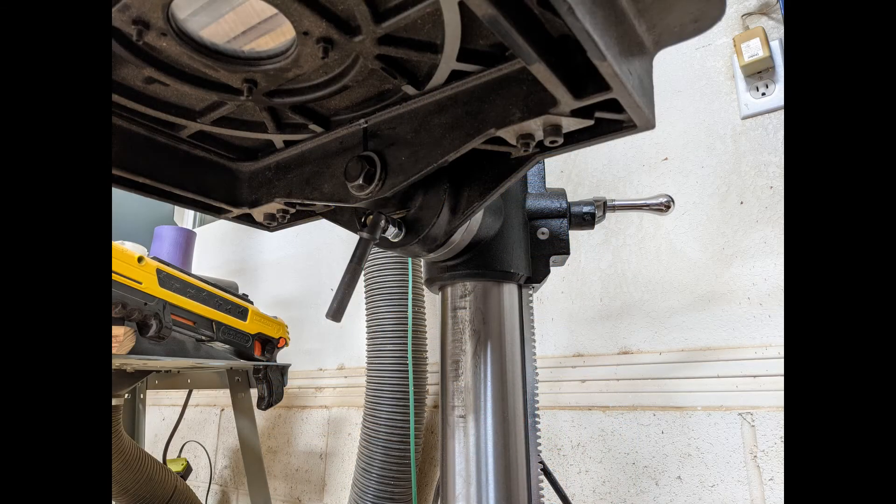In this slide you can see the underside of the table. There's a large nut that tightens the table to the column riser, and then there's a bolt with a yoke that screws in on the bottom — about a quarter inch or so — and engages into the back piece to hold it in the horizontal position.